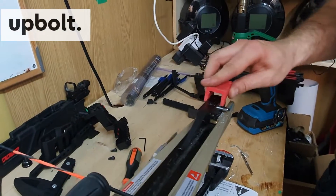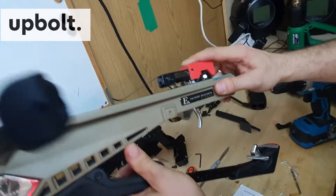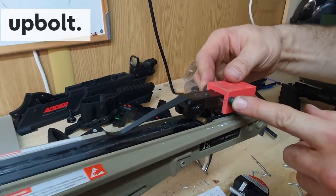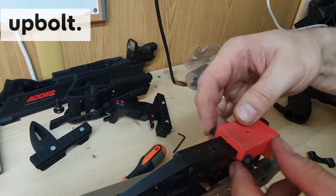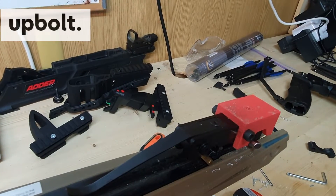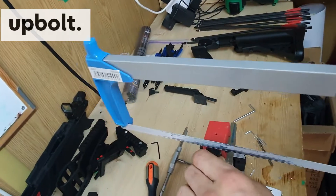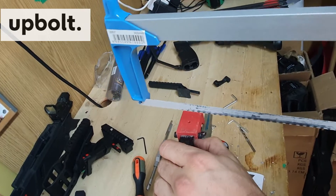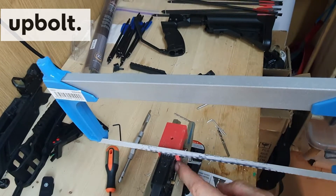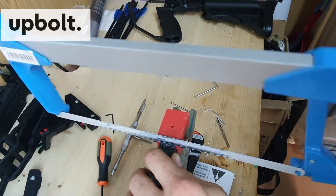Check that the hole is in the right position — you can see it's exactly as it's supposed to be. You need to fixate it at least with those two screws prior to cutting this part. Now that it is fixated, use this saw and cut exactly along the plastic part. Make sure you are not deviating inside the plastic part or away from it — it should be a vertical cut. Let's do it and hope we did it right.